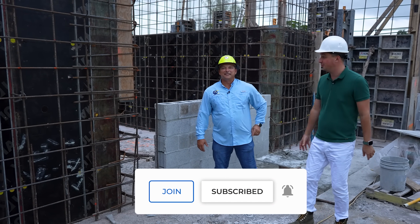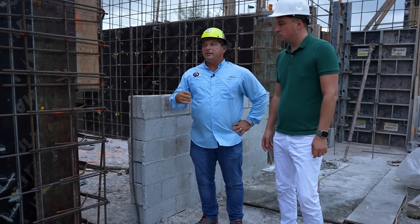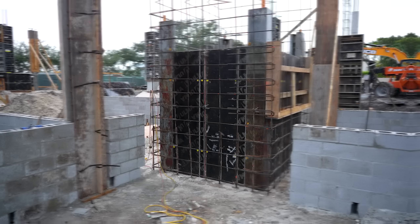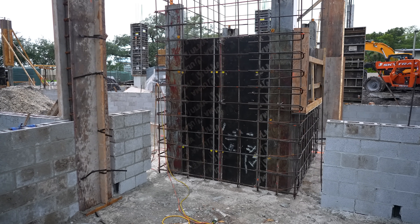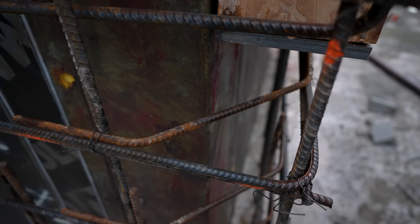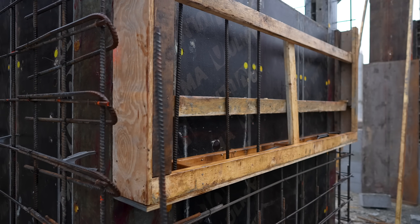We talk about real estate and construction a lot here. This will be the elevator — that's the rebar. All this process is with the engineer. The engineer sends us the rebar drawings and then we submit to build this rebar. We have to put the rebar however the drawing says — about every 10 inches, 8 inches. And this will be the bottom of your elevator.